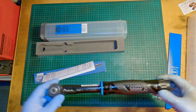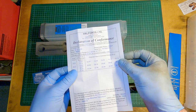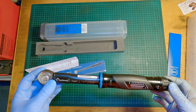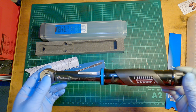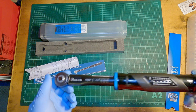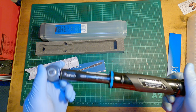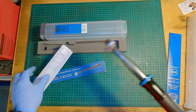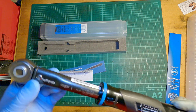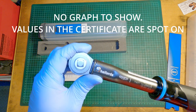So let's get to the second part of the video: is it accurate? Well, we've already looked through the certificate of conformance and it seems to be. One thing you should do with torque wrenches is have them checked yearly at least, depending on how much you use them. I don't have the equipment for it — you see people on YouTube doing it with scales pulling on the end, but then you ask yourself how accurate is your scale. So I'm going to take this, have it inspected, and see how close it is to the values in the certificate. I'll post a graph of the actual set values and how much it reads on the test equipment.